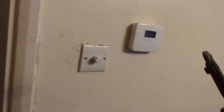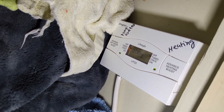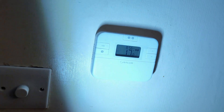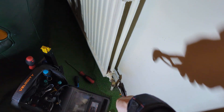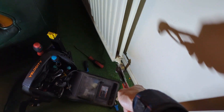This last job: a wireless programmable room stat combined with a twin-channel programmer. The customer says the heating hasn't been working at the right times — the times set on the room stat weren't matching up to the times set on the programmer. The customer is elderly so I've set the room stat to manual so she can just turn it up and down and it works from the programmer. Also, the system was apparently power-flushed recently but one radiator wasn't getting hot — the lockshield valve was shut. Opened that up and now there's heat coming through. Apparently it hadn't worked since before Christmas, but all it was is the lockshield valve was turned off.